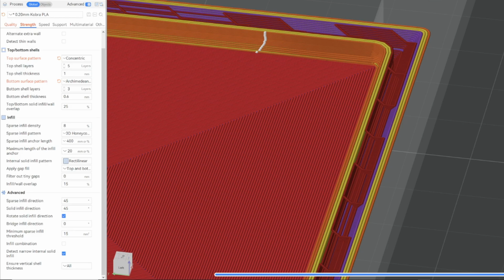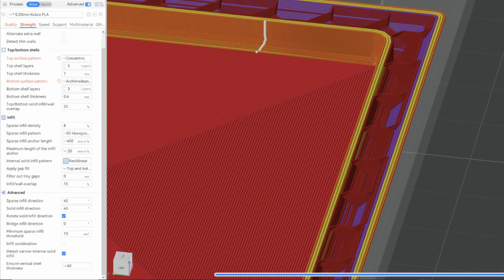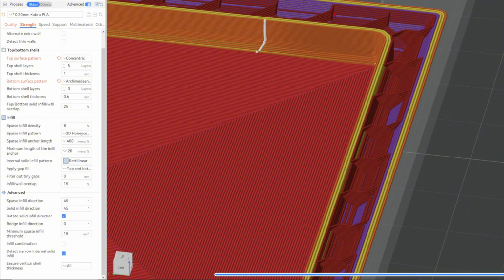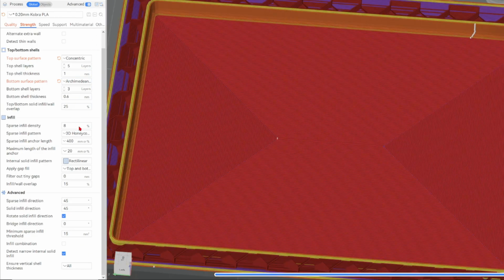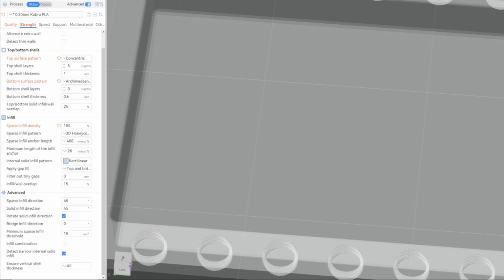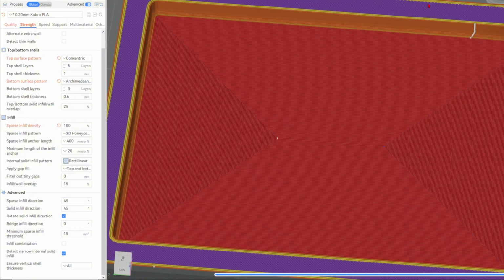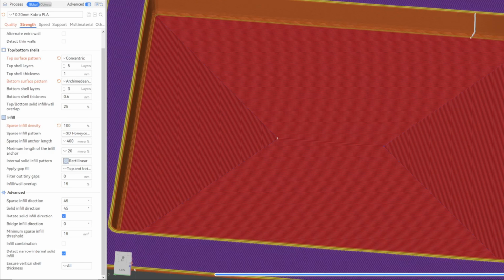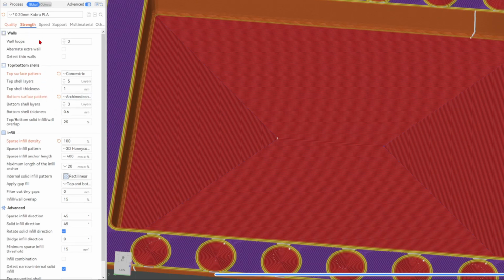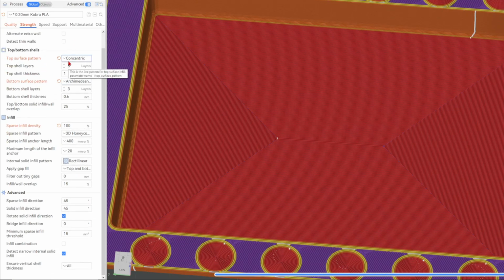It's gonna go all the way over there. If we move up like that, it starts a new layer over here, so it has the maximum support for everything. It's putting everything out equally. Sometimes if I want everything to be filled, I just put this at 100% density, and all the infill will automatically be solid infill, purple like that, and boom, we just have a solid 3D print. But if you don't want that, you can increase the wall loop, which pretty much plays the same role.